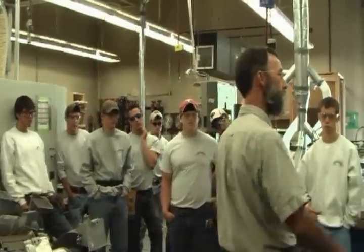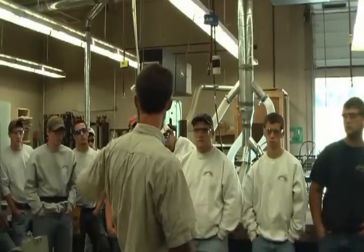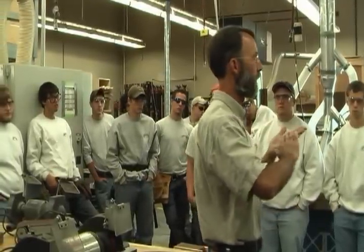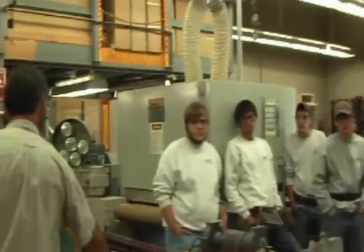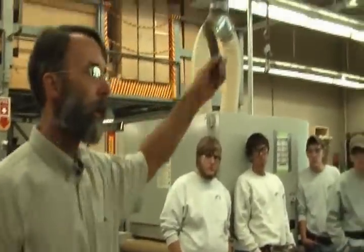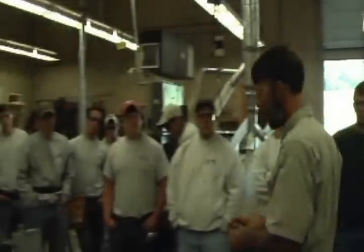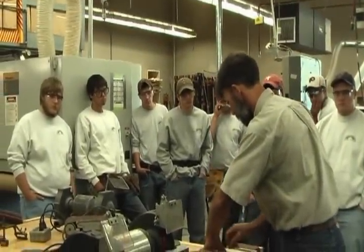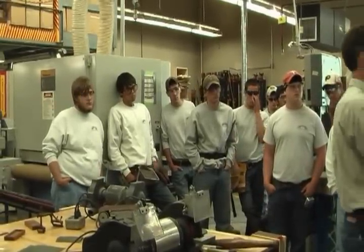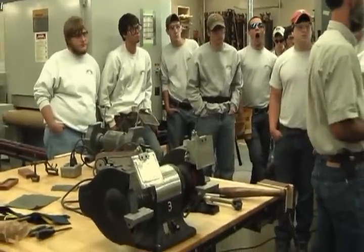Straight razors, you see in the movies, the guys in the barber shop, you know that guy just before they slit his throat? They have a strop. It's a leather strap they have hanging on the wall, and the barber holds the end of it. That strop is a piece of leather, and it has an abrasive on it, all right? Buffing wheels, you know what buffing wheels are? You put an abrasive compound, polishing compound, on that wheel. You do the same thing on a leather strop. You can use an old belt. Find an old belt, you feel the inside of it, it's kind of rough. Take some polishing compound, and you rub it on the belt. Basically a wax with an ultra-fine abrasive in it. On a buffer, you're just rubbing that abrasive across the metal and polishing it up. Right? So if you have a strop, you're good for getting that to razor sharp.